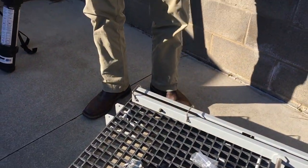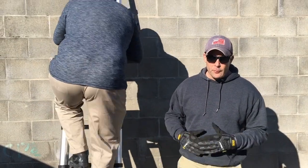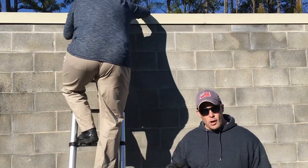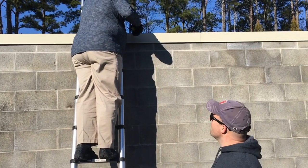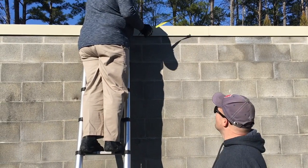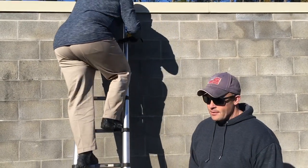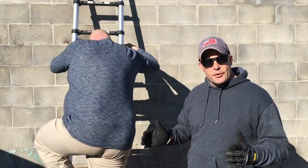This is how you'll receive it and begin. First thing you're going to want to do is determine the thickness of your wall. He's going to go up the ladder, take a tape measure, measure the thickness of the top of the wall. Thirteen inches. Come down and then we'll put that measurement into the hook system.